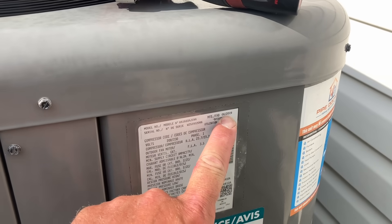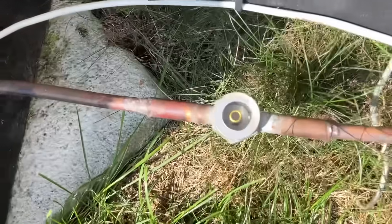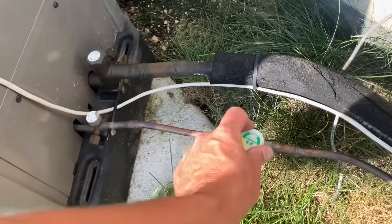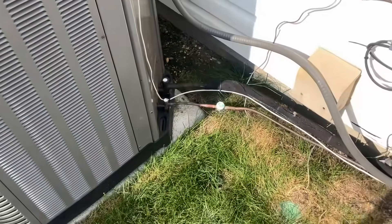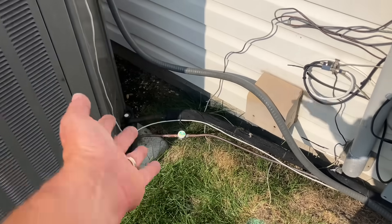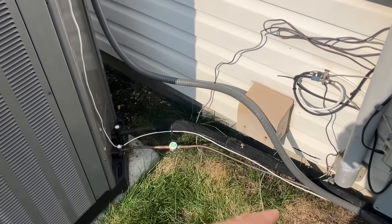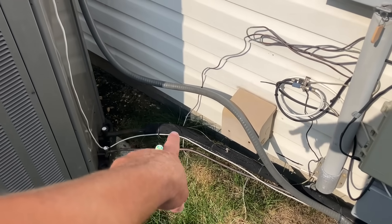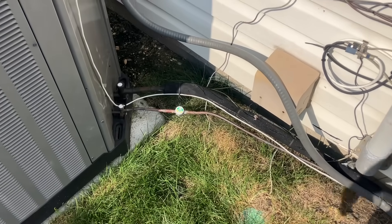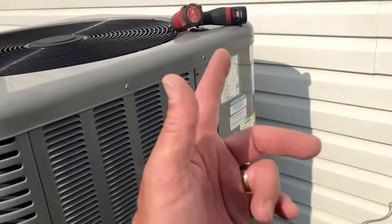June 2019 manufacture date, five-ton system, 60,000 BTUs in the model number. Sight glass is clear — no bubbles, nothing — that's sweet. The filter dryer is located inside. I replaced the internal condensate pan a couple months ago, and every time you cut the system you replace the filter dryer, so it was a good opportunity to put the filter dryer inside. I didn't really like putting two braze joints there, so I just threw in a filter dryer with a moisture sensor — easy peasy, done. She's running.